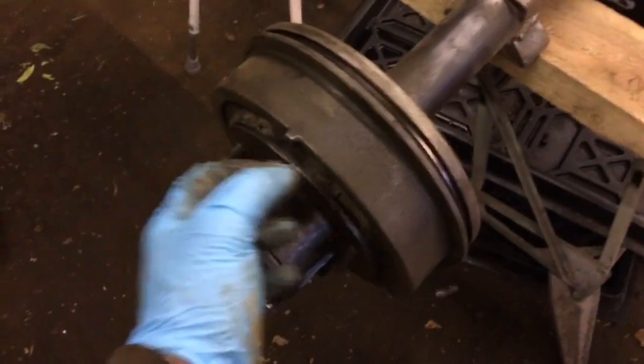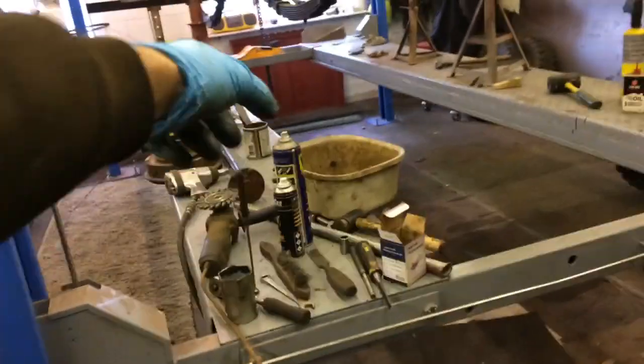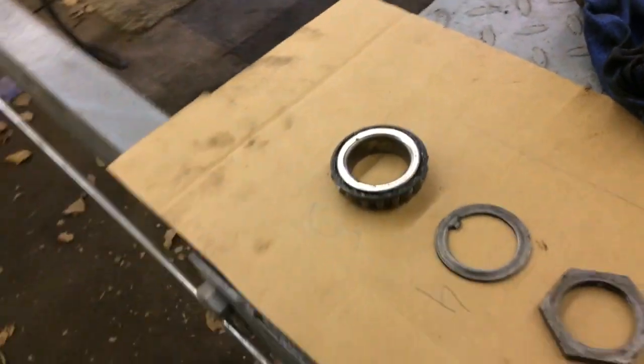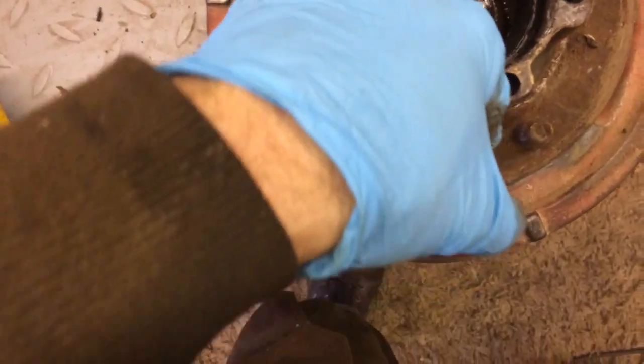Now, what happened yesterday? We started removing this. We realized you can't take these housings off unless you remove the whole thing. So we just took that one off, started taking everything off because we've done it before many times. And suddenly when we were putting it back together, we thought, wait a minute, there's something missing here. To start with, the nuts that go onto this, because this shaft has to run on some kind of a bearing. If not, it would create too much friction and it'd be a nightmare. That's your bearing there, with the needles or the rollers or whatever on them. Some have balls, and anyway. And there's an internal bearing there, inside, and that one goes on the outside. Now, that may need replacing. You don't know, 75-year-old car.